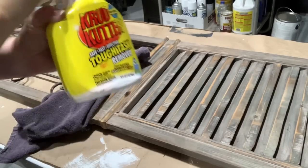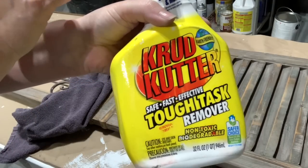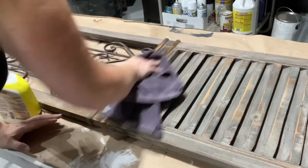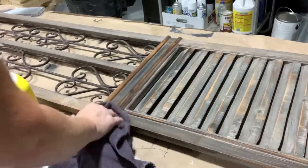On the big decor piece, there was nothing that needed to be fixed or sanded off. So now I'm just getting around to cleaning them off with the crud cutter. I just spray it on a rag, wipe the item off — it is a great prep, no rinse needed whatsoever. Then I rub it on to get any gunk, any dust, any buildup that might be left. This one was way more dirtier than you think. This is why your paint would not adhere properly if you do not get this off.